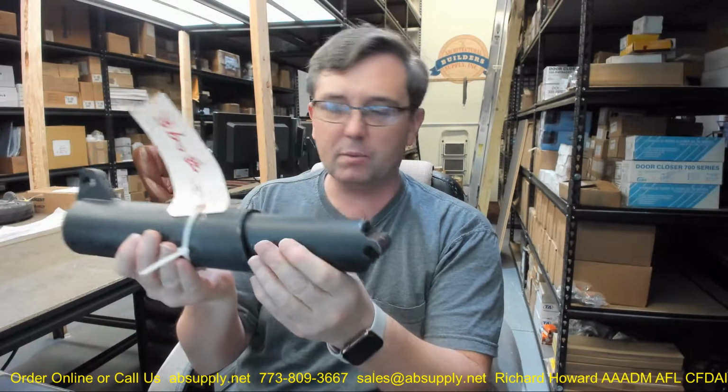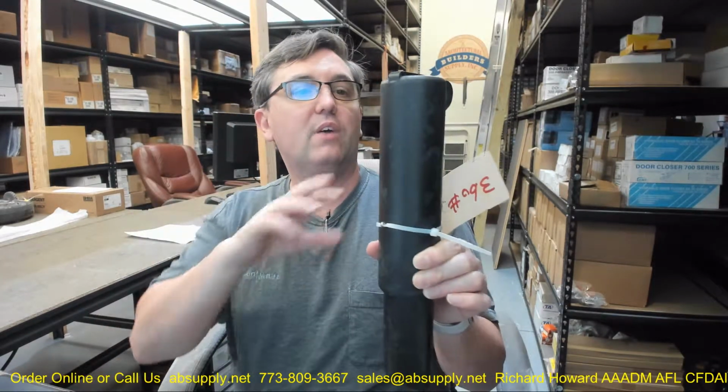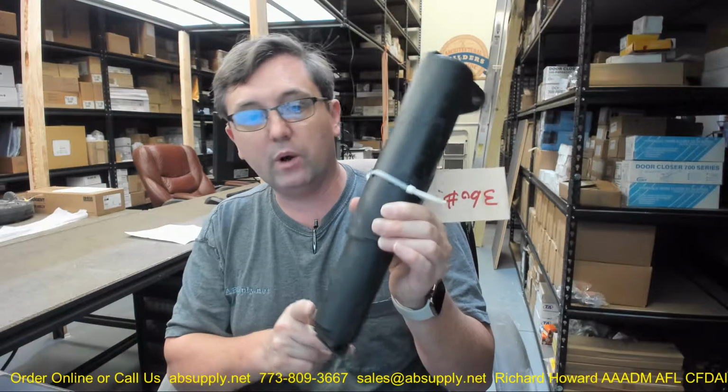This video is to bring you a closer look at the Bilco number KT360N. This is a lifting mechanism. This is a unit that I know for sure works on modern versions of their S-20 standard roof hatch. If you have a model with a single lifting mechanism, according to the factory, the KT360N is what you need.